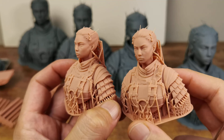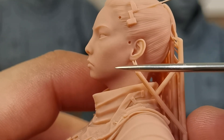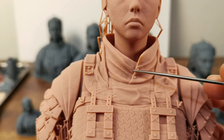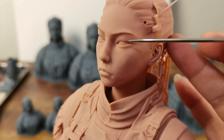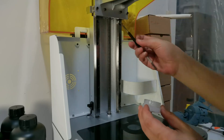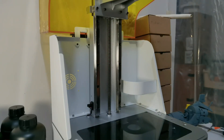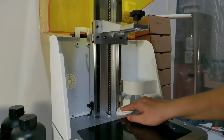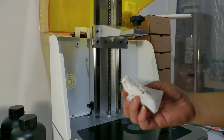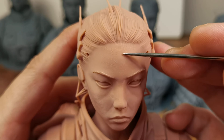When checking the lady techno samurai model, I realized I had an issue with bigger model test prints. All models larger than a certain size had bad print lines. I thought maybe the rail was not well-lubricated, so I applied some grease and moved it up and down to spread it. The rail got dirty, which I thought meant the dirt had flushed out from inside the block — problem solved, right? Nope. The bad print lines still existed.